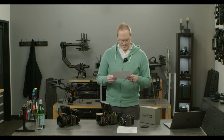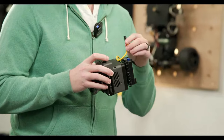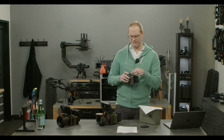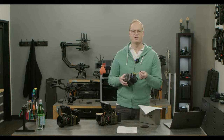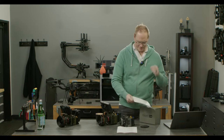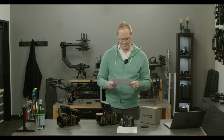Why 4-pin Molex and not Lemo for power? The power input cable is a locking Molex connector. We use these because they're super lightweight, super robust, cheap, easy to get, and small. Once you start putting Lemo connectors all over a camera, it drives the form factor to be huge and heavy. We've been using these connectors on Movi Pro for years — they're bulletproof, thousands of them in the field. I think there's a Lemo lobby somewhere that has led the entire cinema industry slightly astray with bigger, heavier, more expensive stuff than needed.